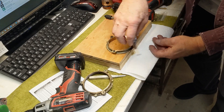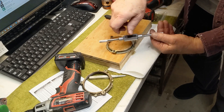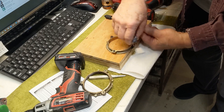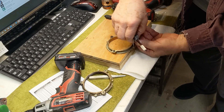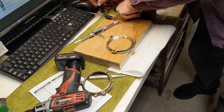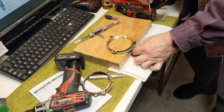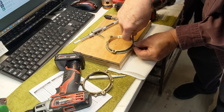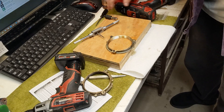I'll go all the way down to the bottom of the threads just to make sure they're nice and clean. So this is a 3.0 tap and I had a 2.5 millimeter drill bit. Backing it out now — got tapped all the way down. I don't want to damage the threads in any way. Here's my 3.0 by 0.5 screw — I'm just going to check it out, make sure everything's great. Perfect. Okay, so that side's done. I'm going to do the same thing on the other side.